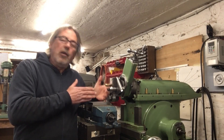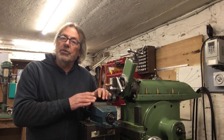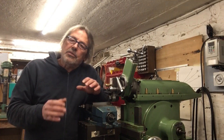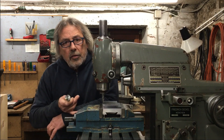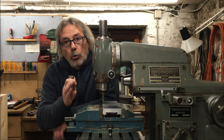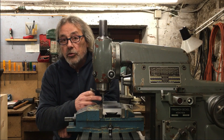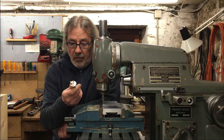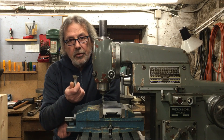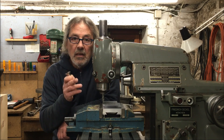Let's start with the shaper. The machine is all set up and ready to go. I don't time the setup because I think the setup of the shaper and the milling machine is more or less the same. I will rough the dovetail with a 12mm end mill and the final touch I will give with my brand new little cutter. Since I never used it, I have no idea how it's going to perform, so I prefer roughing out first.